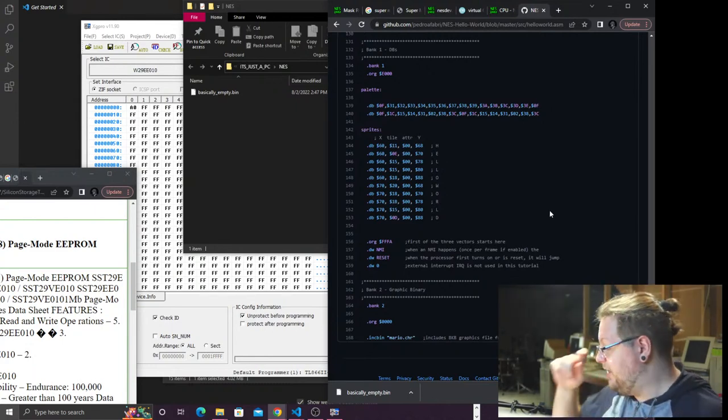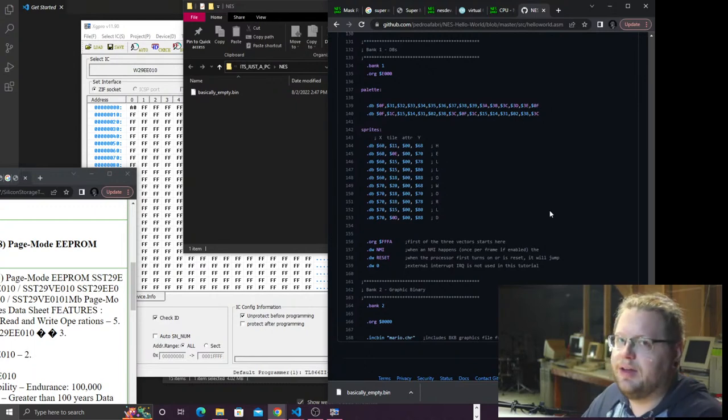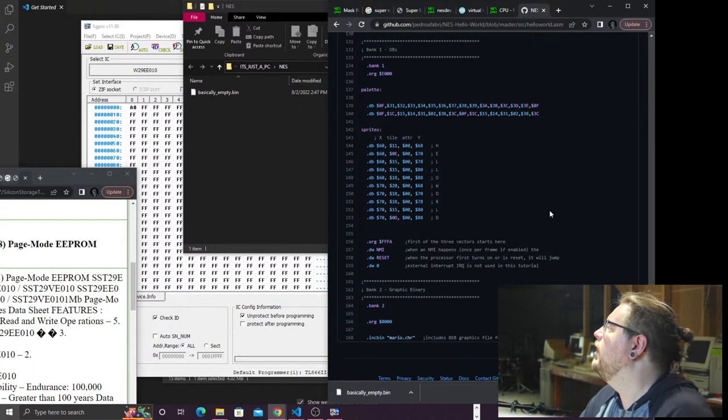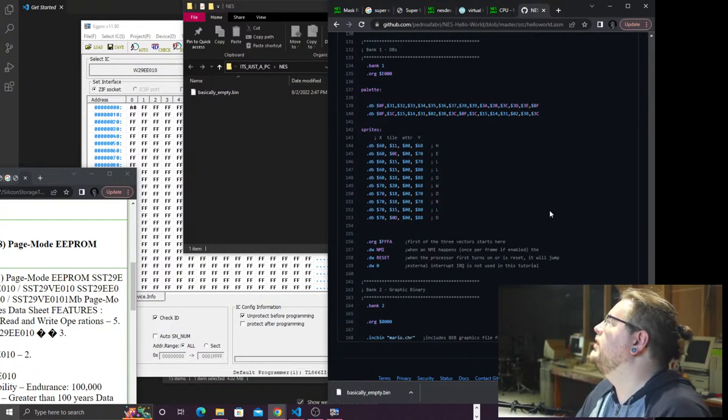Let me look at chat, because I haven't since I started looking this up. I don't know what the story is there with the V-blank thing. The NES has a V-blank interrupt because the PPU has an interrupt line attached to the interrupt input of the CPU so that on V-blanks an interrupt fires, but as far as the handler, you have to insert a handler into the vector table. Let me read. As far as I know, it needs interrupt vectors: reset, NMI, and BRK. Yeah. It has its own V-blank interrupt. There's no way to have that without its own ROM. Oh, yeah, I don't know.